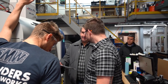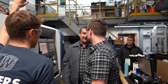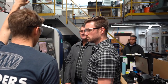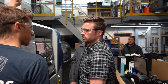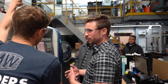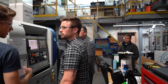In terms of getting almost one size bar because of your parts, I think we can play around with that. It depends on how you're going to process afterwards and how much ground stock you have for grinding. Right. If you're setting up one machine to basically make one part, guide bushing stays the same, bar feeder stays the same, you're just loading material and changing inserts, that's kind of a dream, actually. A single part, like a few different sizes. You know, people always complain about Swiss lathes being hard to set up, time consuming, takes a whole day to set it up, whatever.